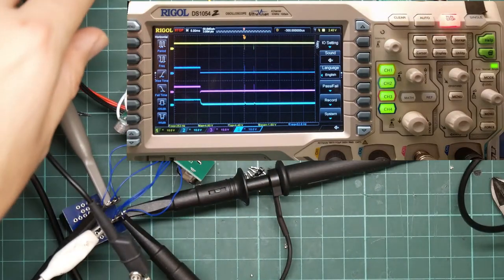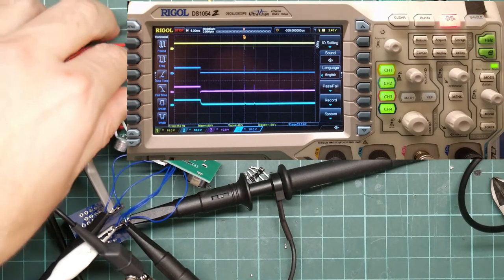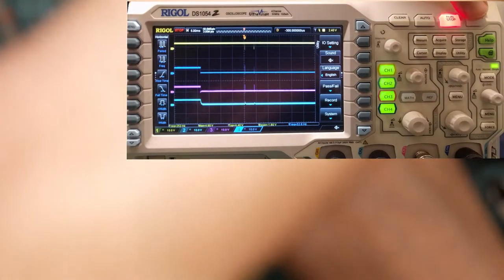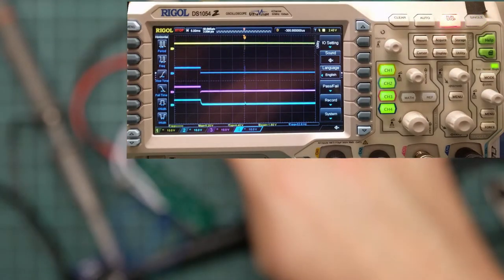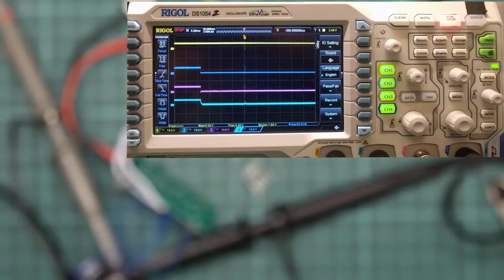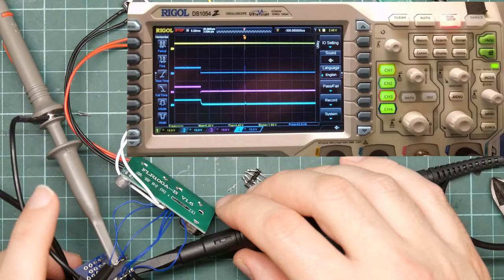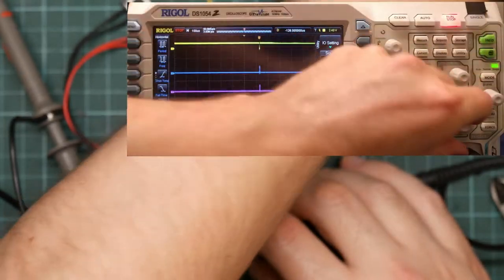Okay, here we are. And if I run it and go, we get a capture, but it looks kind of terrible. And I'm wondering whether I actually have stray capacitance in these wires. That will cause everything to go horribly wrong. If this is trying to push 8 megahertz signals across that, let's just try record instead. I don't know the order, actually. I didn't plug them in the same way round as before. So, channel 1, that's yellow, should be chip select, actually. But that's not... There's a little bit of a glitch here. But I don't believe it signifies anything.